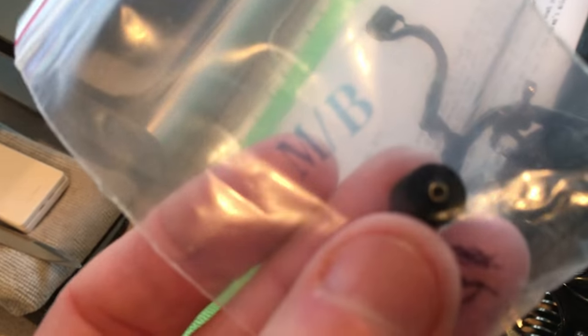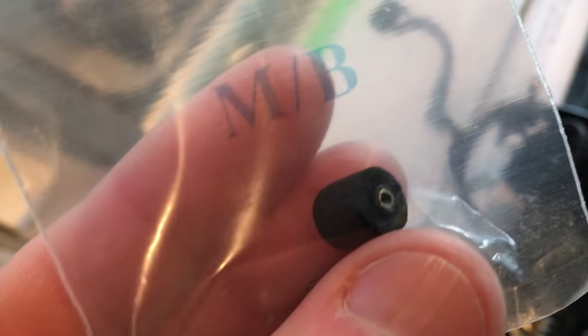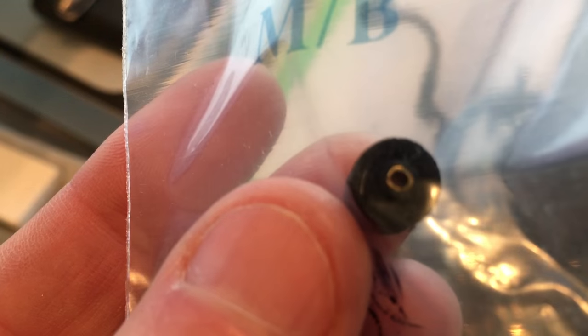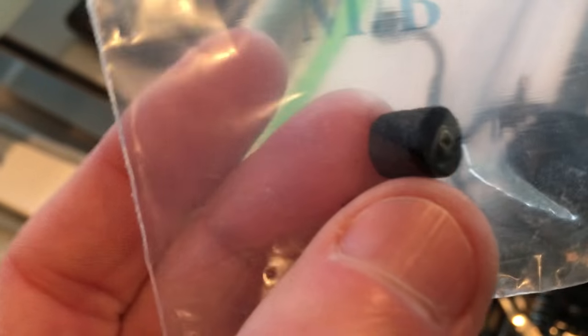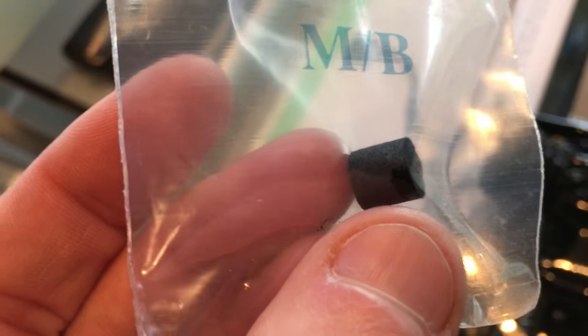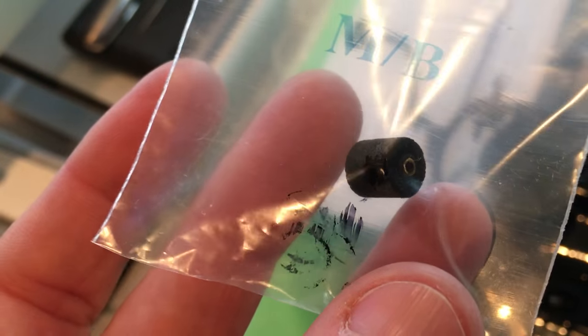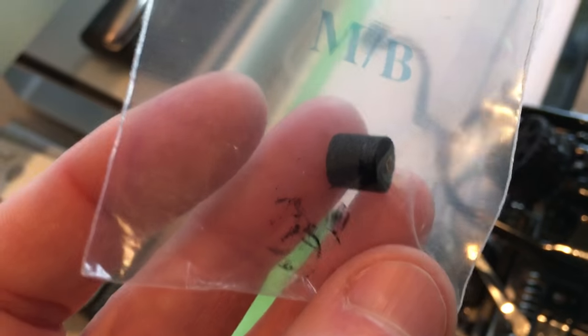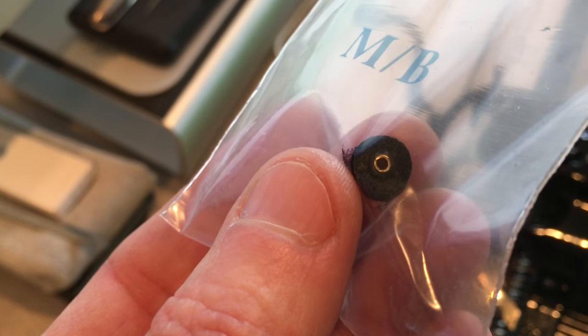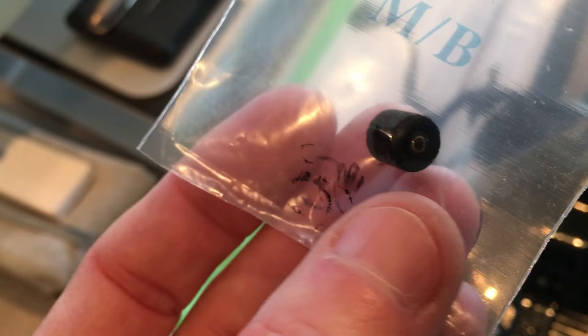This is another one that I made — you can see it a little better. I'm selling this one on eBay. I took a little brass tube and made an arbor for it, then I took apart the PR-40 roller and cut it down to the proper size. So I made two of them; this spare one I'm selling on eBay. The original Blickensderfer has a little brass tube in it, so I wanted to make one with the same design. Real happy with how that came out.